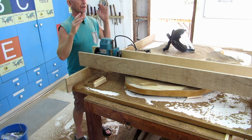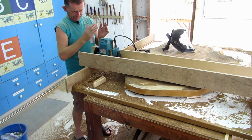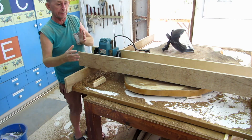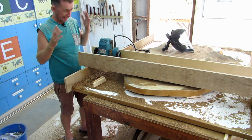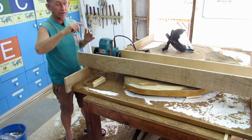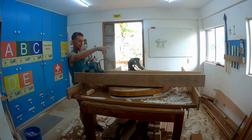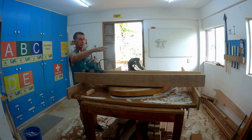When routing, your wood should be on your left so you're not driving over the wood - you're cutting into it, going clockwise. If you were driving you'd be going the other way. So always have the wood on the left. As I'm driving here going down this way on the wood, that's the way to do it. Don't be tempted to go over and back again because the router will start driving, and if it starts driving it becomes dangerous. Pass it over to the other side - it's a much safer way. Going two inches at a time, it's fairly quick even though we're only one millimeter deep.